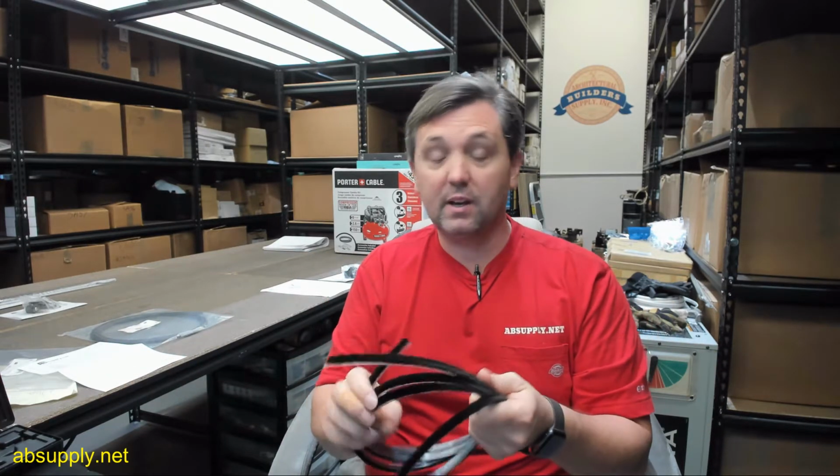Being able to purchase replacement insert is useful, because pile, neoprene, silicone, polyurethane, vinyl most especially, will certainly fatigue with time. And if you are able to retain the part number of the weather stripping that you bought for future reference, you ought to be able to go back to the Pemko catalog and search for that part number and then get the part number for the replacement weather stripping. Because this material is just something that's likely from the factory on a roll, you can order any length you want.